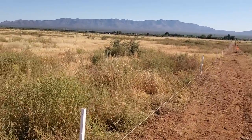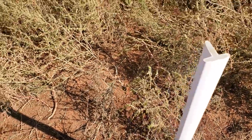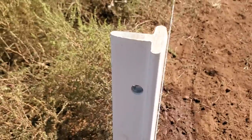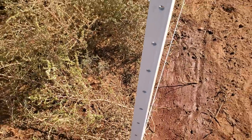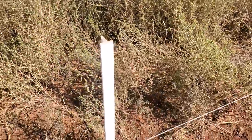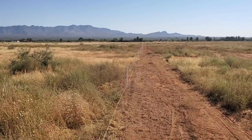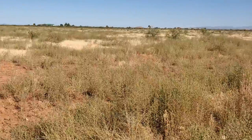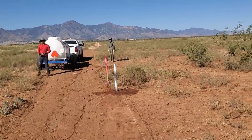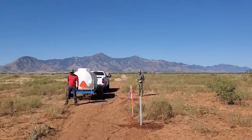Look at that — you can see them all the way down through there. That's what I love about these Timeless posts. This is the inch and three-quarter model, shaped just like a T-post. He's actually using a sledgehammer just to give the final tap into the ground. We've got wire on these — that top one is 32 inches, and then we come down at the 16-inch level. There are eight holes in there that you pick from. Once we get all these driven, that poly braid will be rolled up, and then we pull our high-tensile 180,000 psi hotwire all the way through from the corner post all the way toward that mountain range. This is a long piece — it's 4,000 feet long. It's going really quick though; we're going to be there probably in three hours.